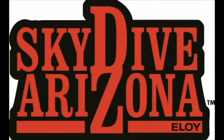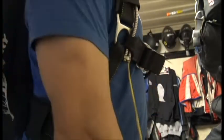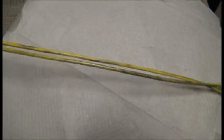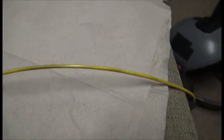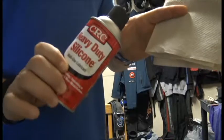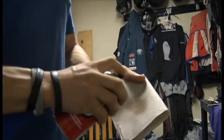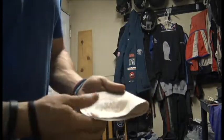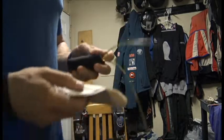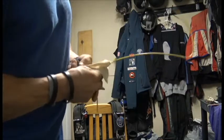Safety Day 2019. Dirt on your cables is going to add resistance to the pull force when it's time to cut away. You can see a lot of dirt gets built up, so I'm going to show you how to remove it with some silicone and some paper towels. This cleaning process should take maybe three or four minutes. Apply the silicone to the paper towel, and have a couple of clean paper towels ready because we're going to get some dirt off and we'll want to continue cleaning without using a dirty paper towel.